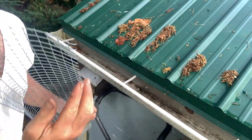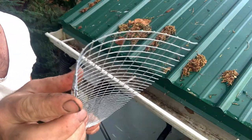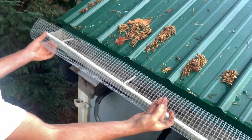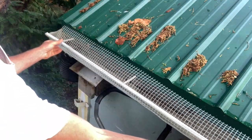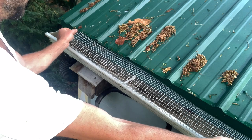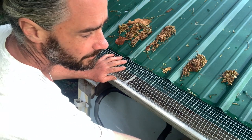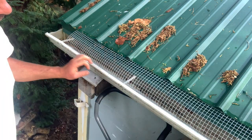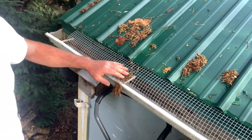I'm doing a test fit right now. The pointy side faces up and goes under the metal. The downside with the smoother edge is folded over, and that cups in and goes into the gutter. This is very much early sketches, but it feels promising. I'm going to leave a little space on the far end so I can reach in and pull stuff out just in case. The one downside is I don't love the metal scraping on metal, but once I work out the kinks, that'll be minimal. That fits really easily — four feet of roof area that should no longer take on really big leaves.